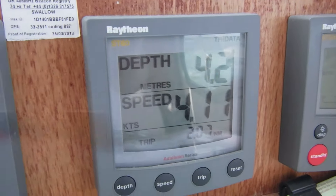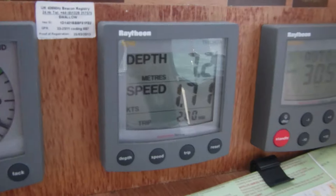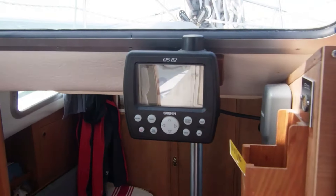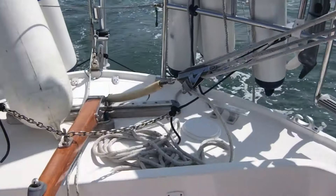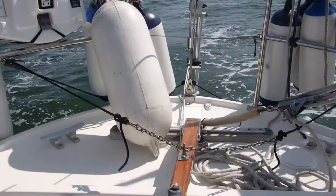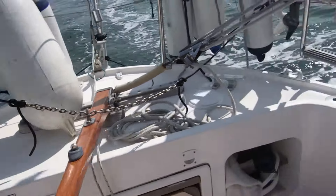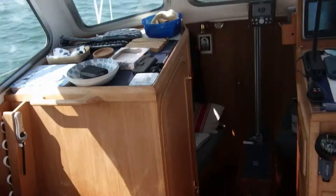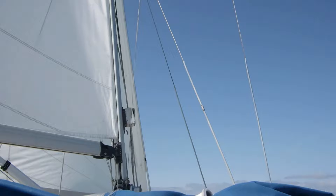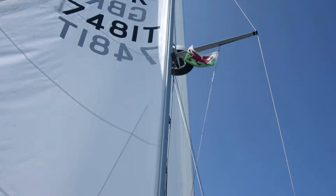As I get out of the main flood, over the banks I go — just two sails. She slows down to 1.6 through the water, 1.7 through the water, but she's doing two and a half over the ground. Something's wrong there. I'm punching into it, so that obviously means I'm doing more than my through-the-water speed indicates. If you're punching into something and doing two and a half knots over the ground, you've got to be exceeding that — so my 1.6, 1.7 is inaccurate.